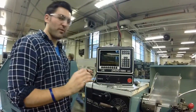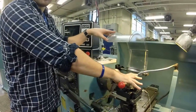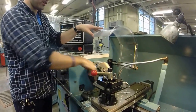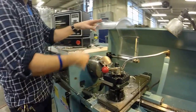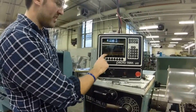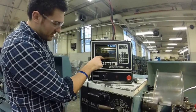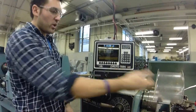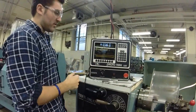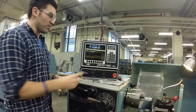The last thing before we start programming is setting up our home position. The home position is where the cutting block goes when it starts or finishes a program. If the cutting block is partway into the part it will cause a tool collision, so bring it to a clear location. Go to set up, then set home. Set X to 2.5, ab set, and Z to 0.6, ab set. Now our home is set and we're ready to start programming.